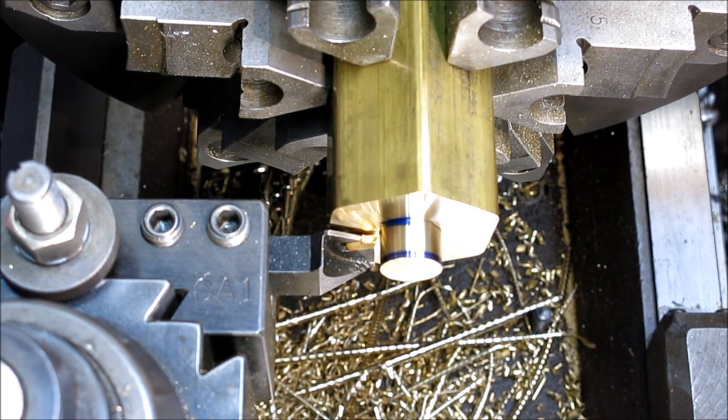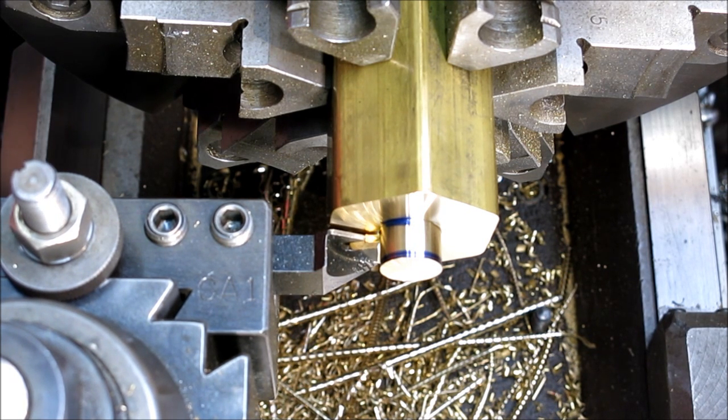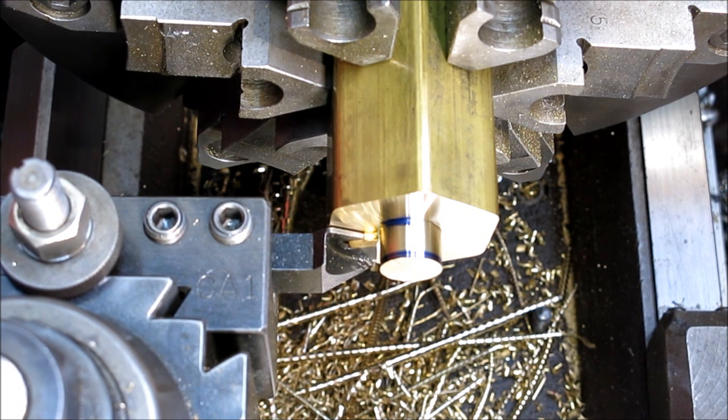So let me shift to that tool, which is number two. So let's see here. I remember how to do this. Tool program run, yes. Enter tool number two. Enter. Okay, let's verify that. So it should, when I touch off, yeah, it's reading that diameter. Okay, great. So we're going to go in about 60 thousandths, because that's just a whisker more than the thread depth.